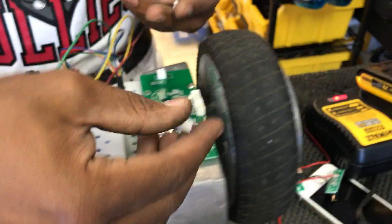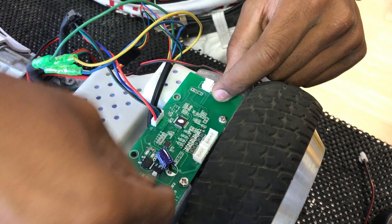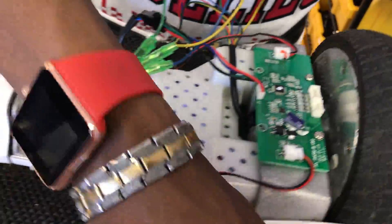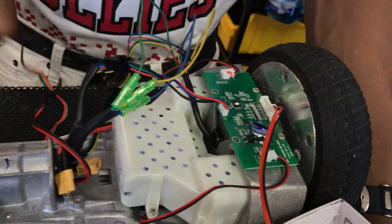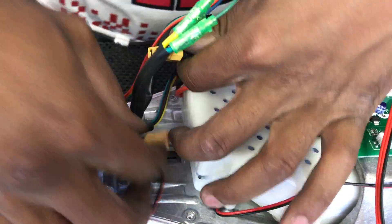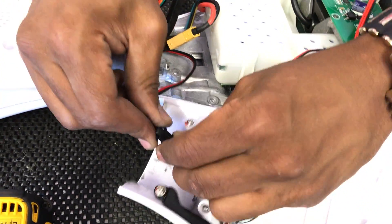Then you have your foot sensor wires — these are the new foot sensors and they connect in here. Just focus on the one on your left hand; it snaps right into place. Then you want to connect your LED to your LED, and your indicator to your indicator — indicator to the gyroscope. Now the battery: don't forget the battery. Take your battery wire here and connect it like so. The last wire is your Bluetooth to your Bluetooth — if your board has a speaker then you can plug your Bluetooth in.